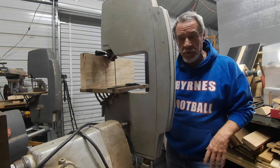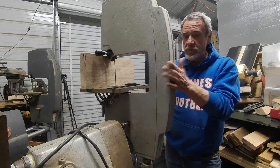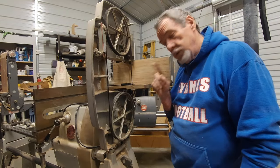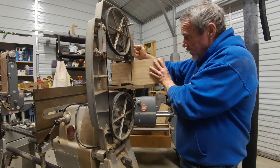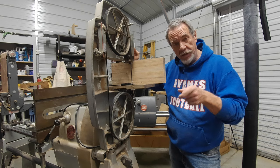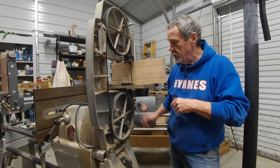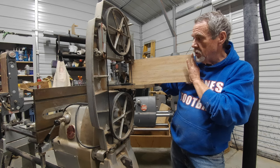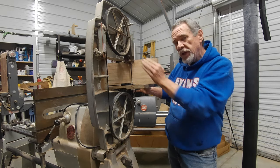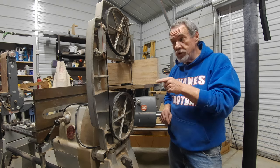If it goes bad I can always put it back together and bolt the plates back on. It's gonna work — everything I do either works or it won't, but most of the time it does. The goal is to get four more inches of resaw room. I don't have a piece of wood down here I need to resaw bigger than that except for cutting guitar bodies. I need to resaw these and make tops, so after this I'm gonna make a sled so the boards can ride through on that blade — smooth and sliding — without needing a fence. This is going to be my top maker right here.